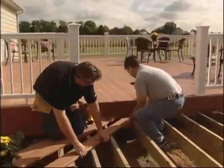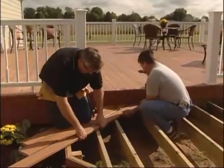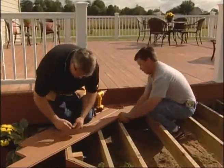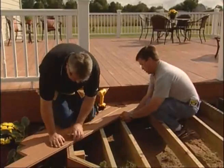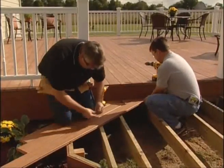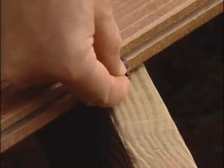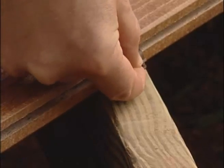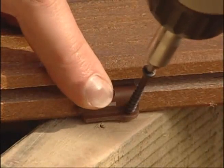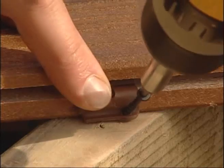Conceal Lock fasteners are designed to allow angled installation up to 45 degrees. When using Conceal Lock fasteners on an angle, offset the center a half inch towards the long part of the joist so the long part of the screw will not exit the side of the joist when driven. Then just continue until all planks are installed.